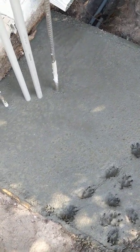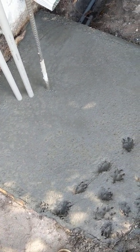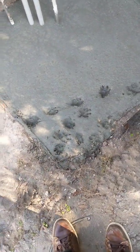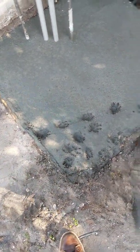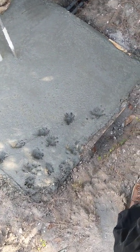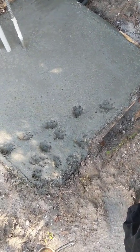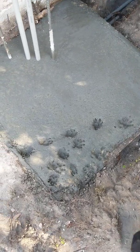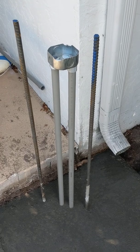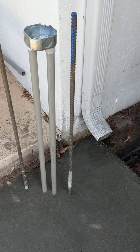Square it off and fill it up with concrete. You don't need a truck — just have a couple of five-gallon buckets, get some quick-mix concrete, get a drill with a concrete stir paddle. It's a real long paddle that goes into the drill. You turn it on and it'll mix that concrete up for you. Pour in the water, start turning it while you pour the concrete in.